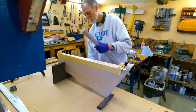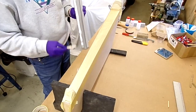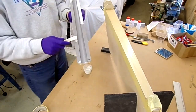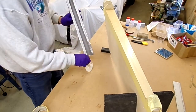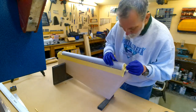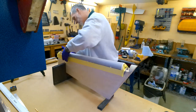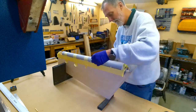So okay, we'll go a little bit faster. I'm just applying the mayonnaise consistency micro balloon. It's not a dry mix, it's a relatively wet mix, straight onto the foam. And of course it's going to bond onto the resin which has already been applied to the plywood. Once I've got it stuck down into position like that, I'm using the tape just to hold everything central and also to squeeze out some of the excess.